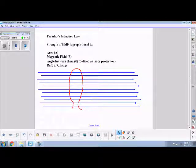This is usually done with a bit of a demo in the classroom, but picture a rod going through the center of the loop, piercing through the middle. That rod would be parallel to the magnetic field. That means the plane of the loop is perpendicular to the magnetic field, which is what we want. So we call that rod going through the loop's projection.